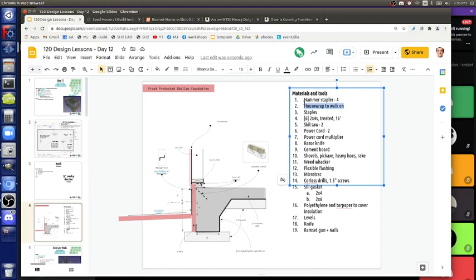What I wanted to do today is, parts of it are going to be muddy, so we want to lay something down on the foundation as we walk there. I think it's still kind of muddy. We can put down some house wrap or polyethylene plastic so we're not getting the foundation all dirty. We're going to take the pressure sprayer. We've got two pressure sprayers. We'll clean it off and then put concrete sealer on it so it gets a kind of shiny surface. It's called concrete sealer or stone sealer.